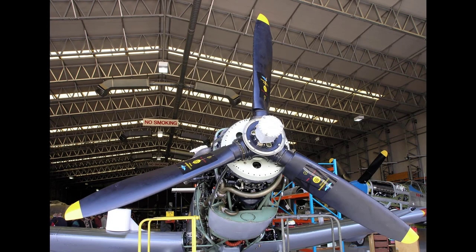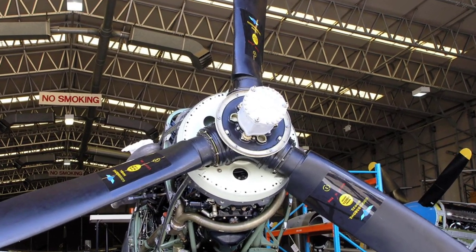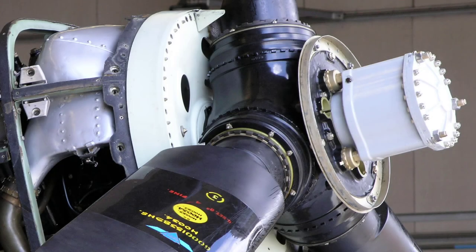With the arrival of increased performance of Merlin engines, it became necessary to use airscrews of pitch ranges greater than those obtainable with the hydraulically operated internal cylinder type of Rotol variable pitch propeller. The construction of the external cylinder group of Rotol variable pitch propellers, such as the RX-510, offered a pitch range of 35 degrees, which was adequate for all normal requirements of constant speed operation, including diving conditions up to the maximum indicated airspeed reading permitted.